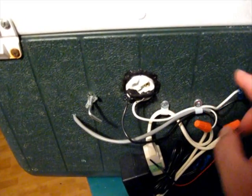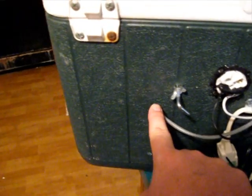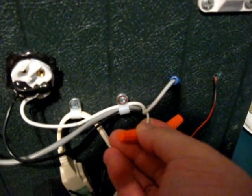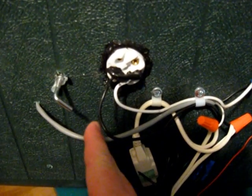The white wire runs out and connects right here — it runs into one side of the thermostat. It doesn't matter which side; no need to overcomplicate it. Then you hook the other side to complete the circuit. The other wire comes out and goes to the other side of the power source. All the thermostat is doing, in actuality, is interrupting the complete circuit.